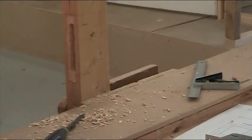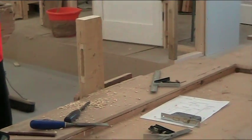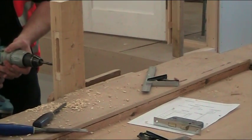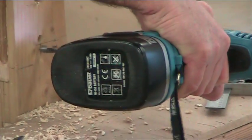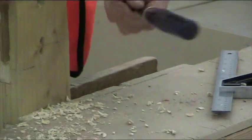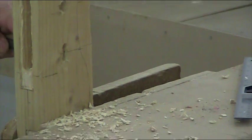With your lock you've got to be a bit more precise because normally you'll just get a small escutcheon which will just cover the keyhole itself. So you're looking for as small a hole as you can get away with. Do one hole top and one hole bottom, then join those two holes up with your chisel so you've actually got a keyhole shape rather than a big hole.